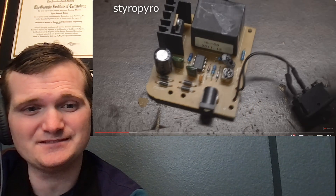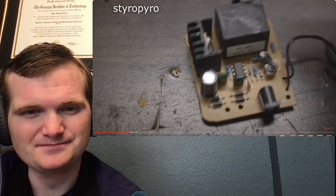The 555 timer feeds into a flyback transformer where the rapidly changing current causes a relatively high voltage to be produced. It's fed through this long lead into the plasma globe. So how do we make this thing stronger? The dumb way would be to just feed higher voltage into the thing, but that's probably just going to blow the timer. The next best option is to feed a higher voltage into just that transistor itself, or even better, use this transistor as an amplifier to feed an even bigger transistor and dump even higher voltage into that.